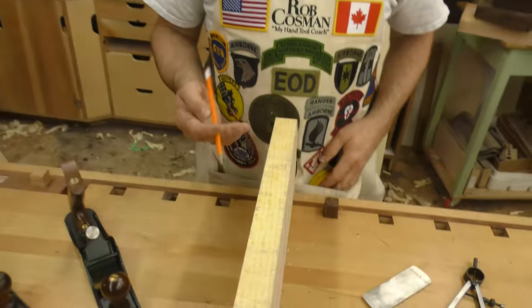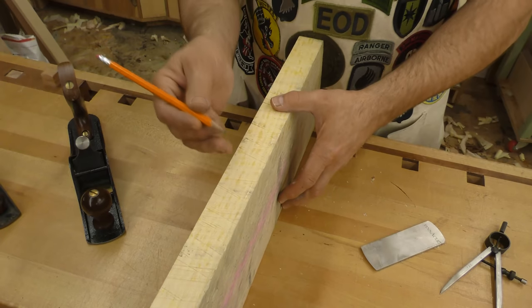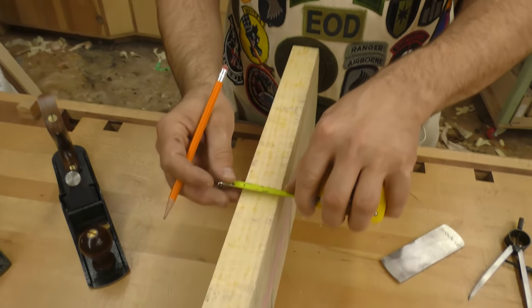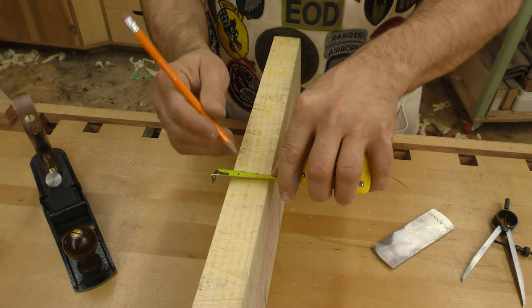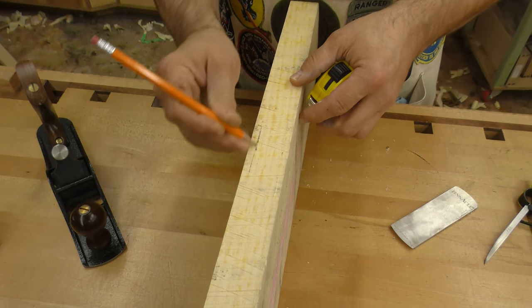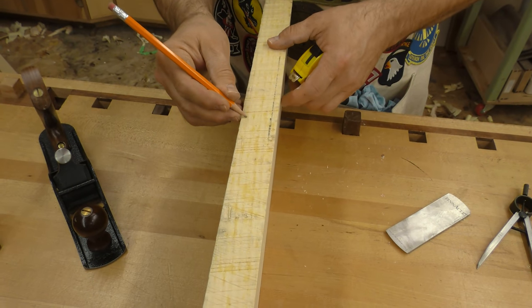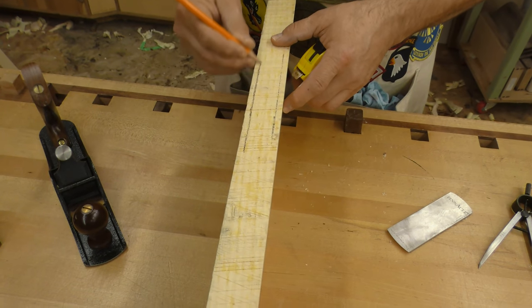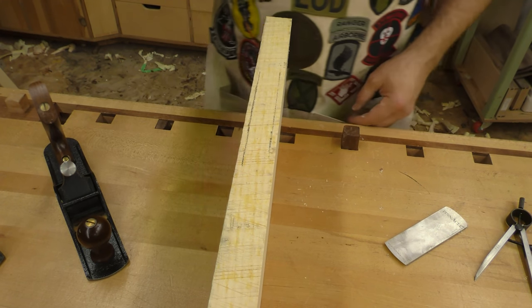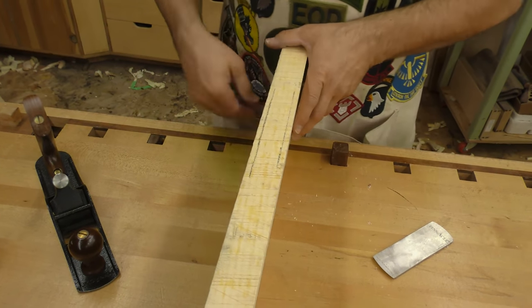All right, back to the bench. It's a piece of northern white pine, and you wanted to get three-quarters of an inch — let's say you wanted to get an inch out of it. You're most stable and your best bet is to take an inch right out of the middle, that center section. Now there's no guarantees, obviously, but if you took a half an inch off one side or the other, you're almost guaranteed to get something that's not going to be stable. So we've got to move a lot of stock.